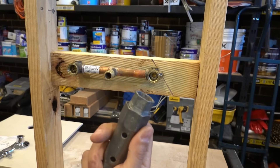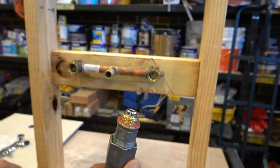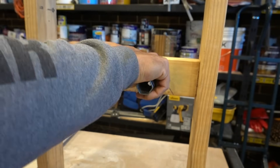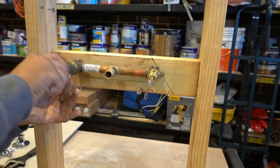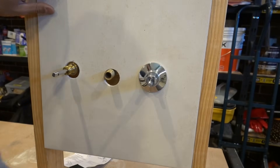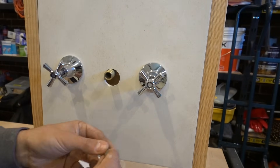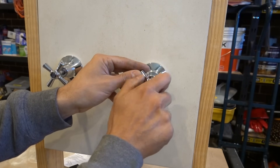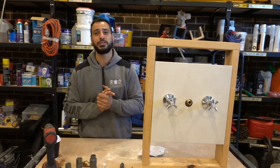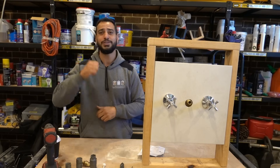Make sure that you've flushed everything out. Use your spindle or tap spanners, make sure you've still got the little seal on there, put on your new washer and thread it on, then do the same on the other side. Put the tile back over, screw on the outer covers, pop on the handles and screw on the caps. That's one video to address all the common issues with dripping and leaking taps — you can do it all yourself from home. Links are all in the description below. Like, comment and subscribe — until next time, I'm Bill, thanks for watching Bill's How To.